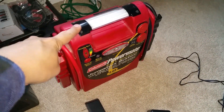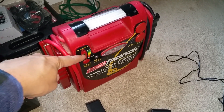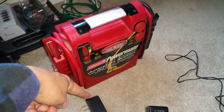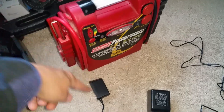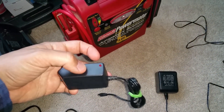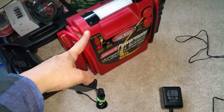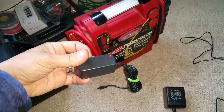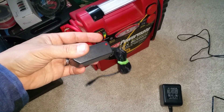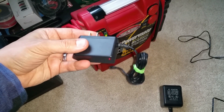Being that this is an older unit, the only circuitry inside is for the battery level meter. There is no way to limit the current from the power supply. So what happens with a switch mode power supply — this one has a light — when the battery is depleted, it's going to try and draw more than an amp from your charger. The charger starts blinking and goes into protective mode. It's not really the right application for a switch mode power supply.